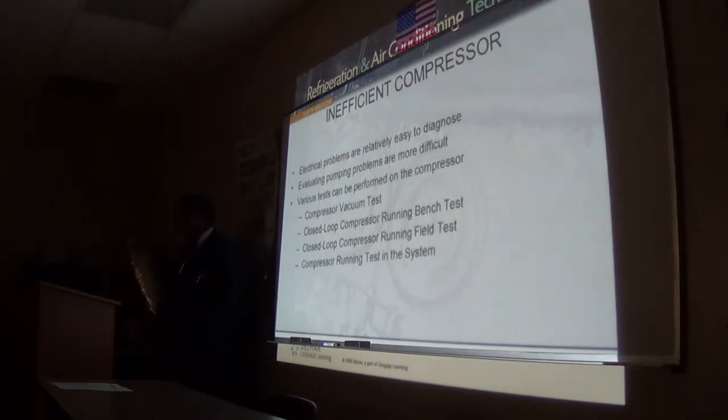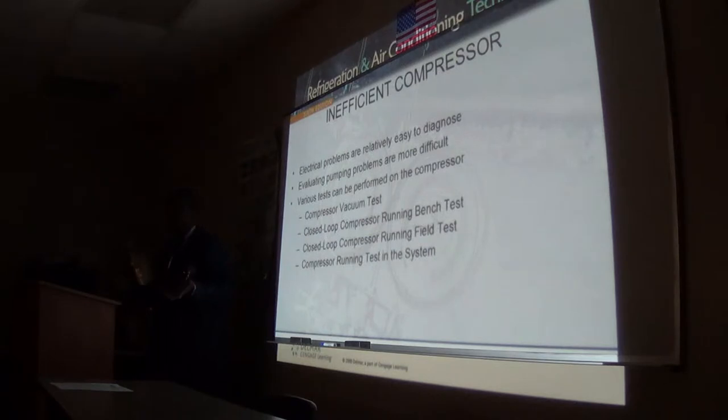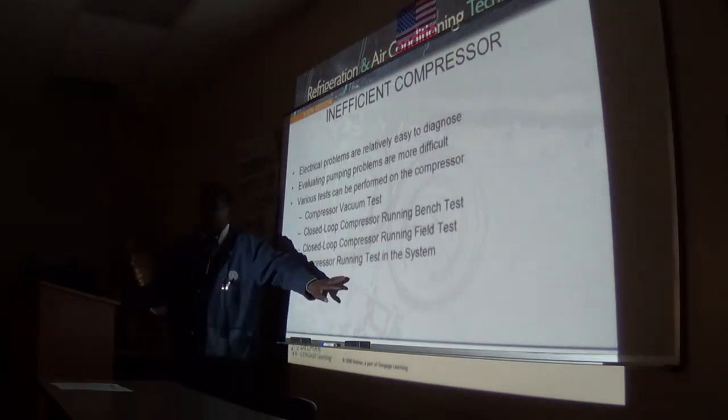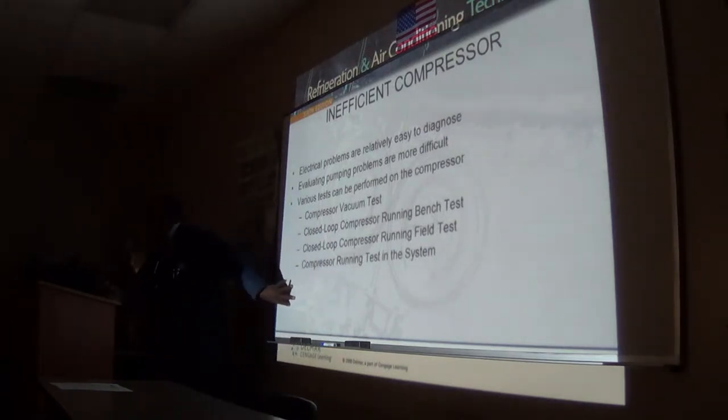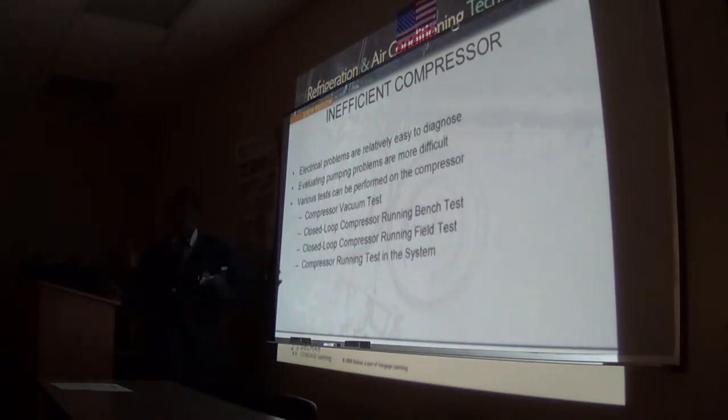The contacts are normally such that when the coil energizes, the contacts close, and it depends on spring action to hold it open. Something happened to the spring. The spring can get weak because of the heat there, because every time it opens and closes, it develops more heat. And this system may not be staying on long enough to blow enough air to cool it down. So always change the whole thing.